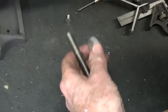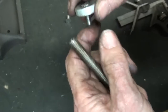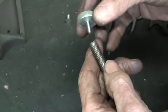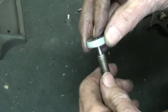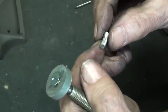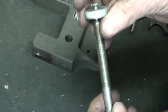I was shocked at how many people liked my video where I talked about countersinking — so take a look at that. I will now countersink this just deep enough so that the flathead screw will be below the surface. It's below the surface. I'm not actually ready to install this in the hole yet because I want to take it apart several more times and the swivel would prevent that. The whole idea is that we want to use a screw of about the right length. If I tighten it down it just keeps the swivel from swiveling — no good. So there are a couple of ways of doing that: one is to use Loctite, or another way would be to bugger up the end of the thread just a little bit in a vise.